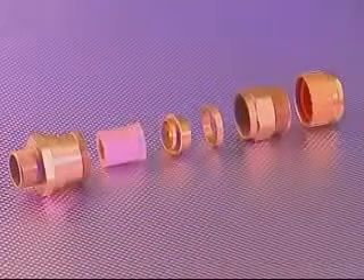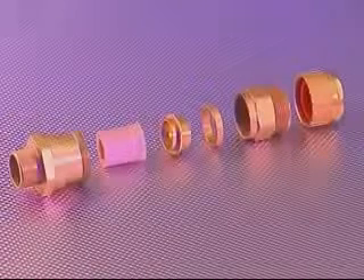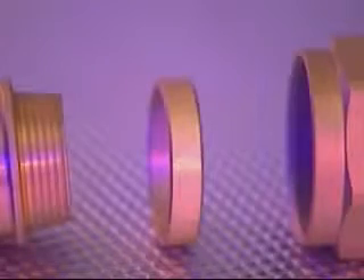The ICG-653 Dedicated armour cable gland comprises six major components, similar to the ICG-653 Universal cable gland. The exception being that instead of a reversible armour clamping ring, the cable gland is fitted with individual armour rings to suit each individual armour type or braid.